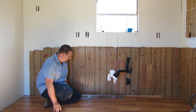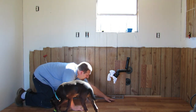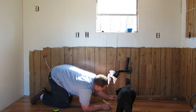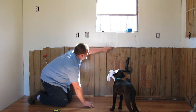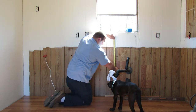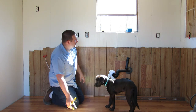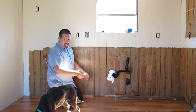I've got my level here. I laid it down and found this area was higher than over there, and checking further I found this was actually the highest point right here. From this point up we measure 34 and a half inches - that's going to be the top of the unfinished cabinet base. From that point you work your way out and shim the lower ones.